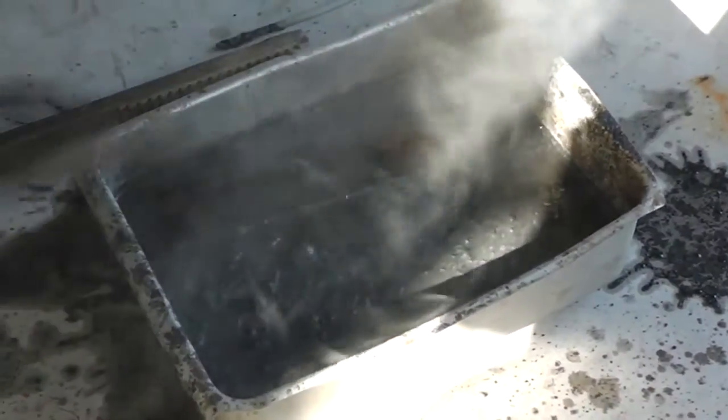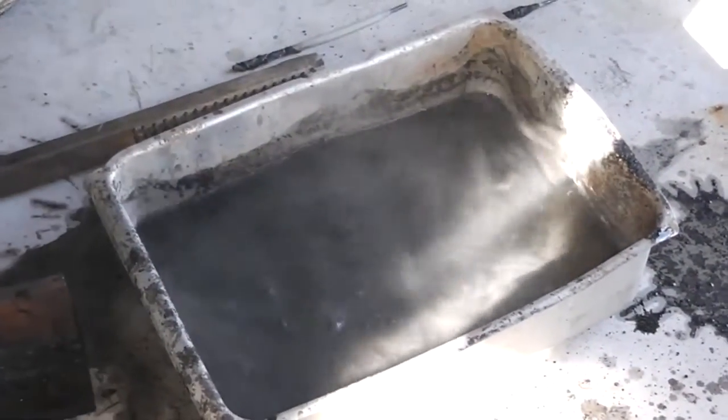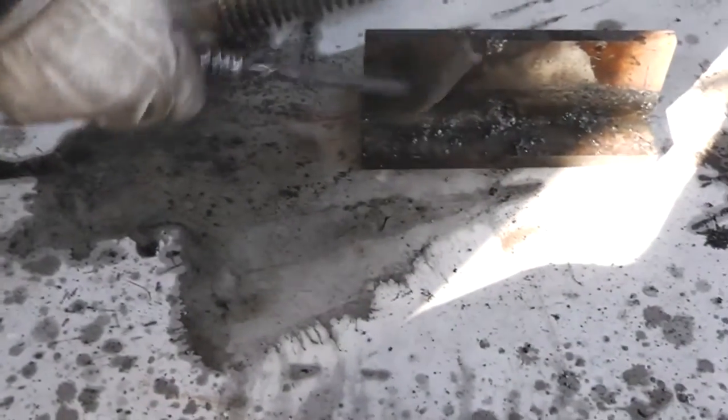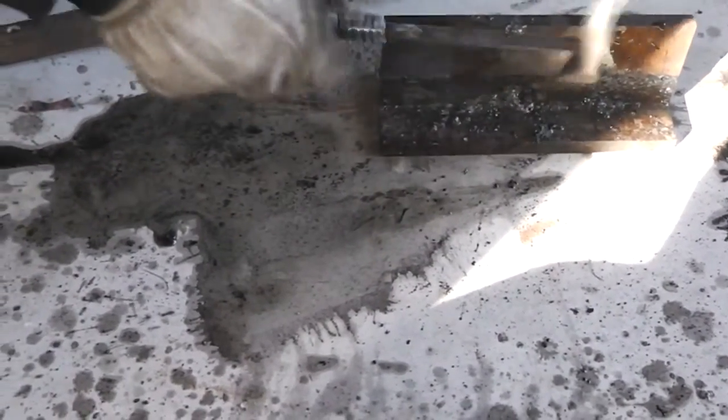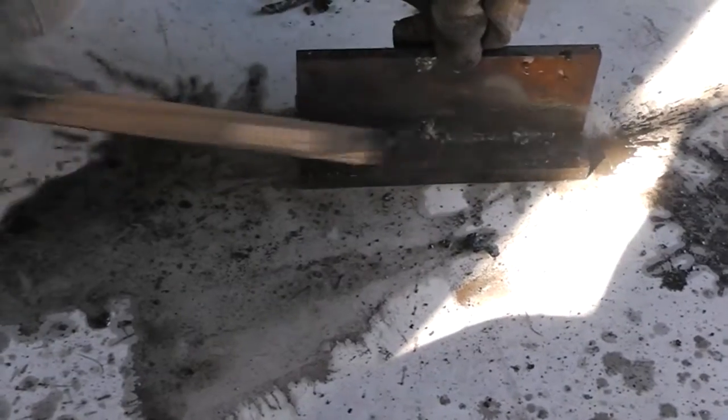Alright, so we got this side done. Oh my god, it's just poop. Your other weld was better. Yeah, the other one was better. You were too hot — it was just burning in there. Well, you can't see anything and the rod is just slipping in. But the first attempt definitely was not bad.